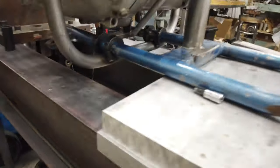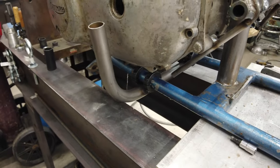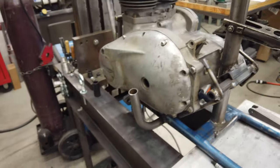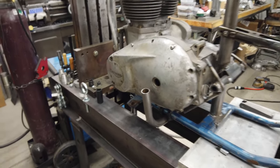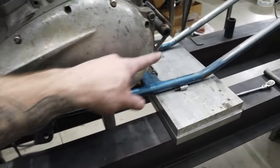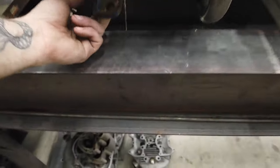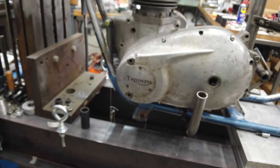Like I said, I ended up with those 1-inch clamps. I overboarded with four of them. That's going to be about as sturdy as it can get. I'll fully weld them once I take it off. I want to be able to actually put weight on it, if I decide to stand on it to kickstart for whatever reason. I don't like it when it flexes and bounces. That's why I'm not a fan of the factory reaching leverage ones. This side stand lug is super stout too, so I'll be able to get away with kicking it on its side stand.